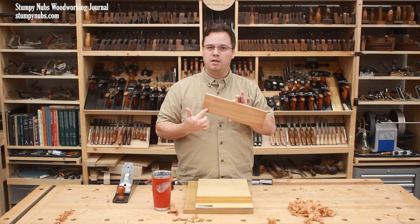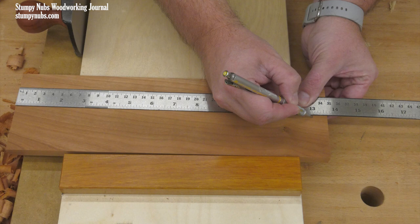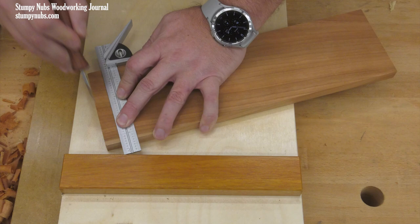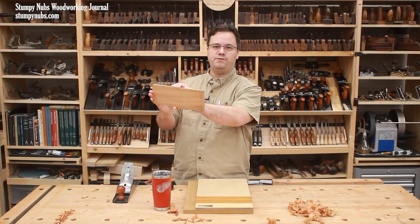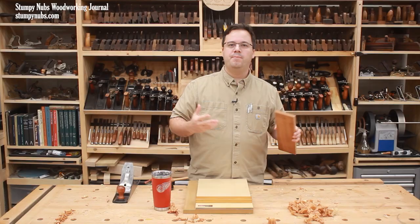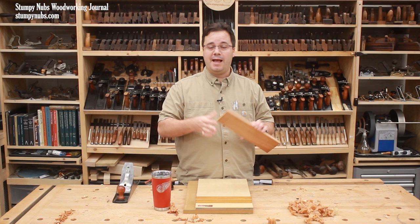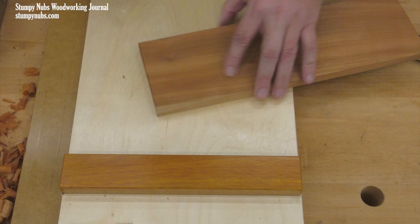For example, if I need this project part to be 13 inches long, I am going to cut it at the table saw to about 13 and a quarter or so. Then I will take the shooting board and square up one end. Next, I will measure 13 inches from that clean end and mark it with a fine pencil, or better yet, a knife. I may even skip the measuring and, if possible, hold my project part right up to the assembly and mark it in place so I get it precise as it is going to fit in the project. I could try to cut right to that line with the table saw, but the shooting board will give me a cleaner, more precise cut, and it is going to better allow me to gradually sneak up on that line as I custom fit the part into its spot.